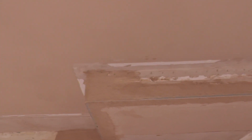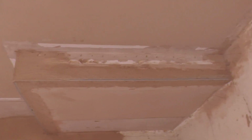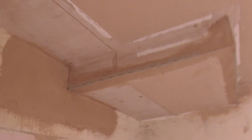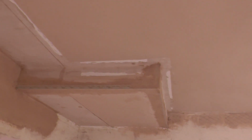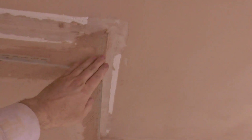So what I'm going to do now is go over and remove any bits of plaster which might be sticking out, any little blobs, odds and sods, that sort of thing. You can see that I've already set the skim bead. I did this a couple of days ago. I've set it in bonding because I didn't have any multi-finish at that time. It's not a problem though. So I just need to scrape it back because it is a rougher plaster than multi-finish, which I'm going to use to skim